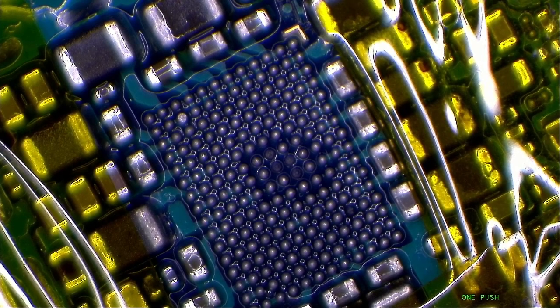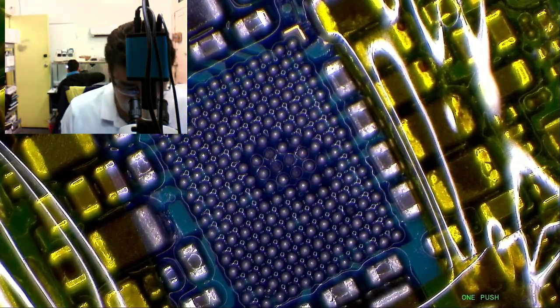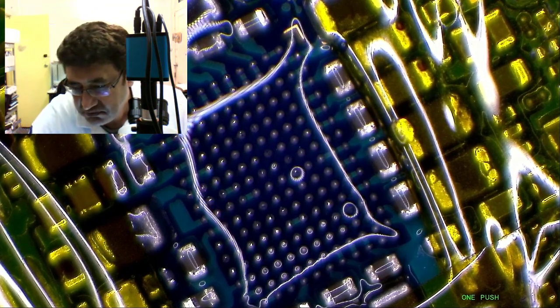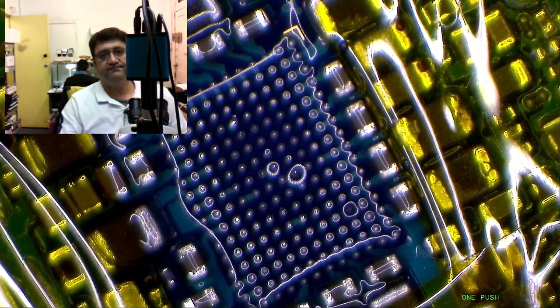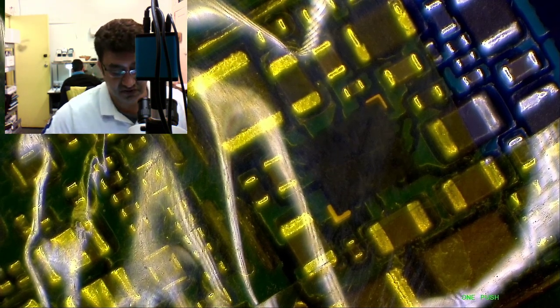In my previous video, I don't usually use solder braid on smaller ICs to clean these leftover solder balls, but this is a little bit bigger area, so we can use it. Let's see how we do it. First of all I will be using a little bit of low melt leaded solder with a smaller tip of the soldering iron, and if it's not cleaned well, maybe we will use solder braid, but not at this stage. See how it goes. So I will start cleaning.